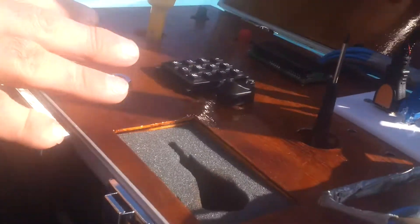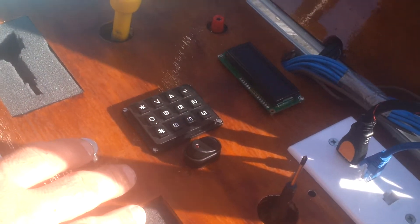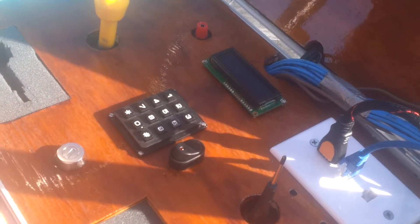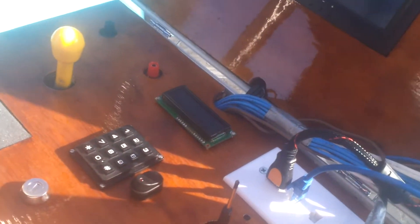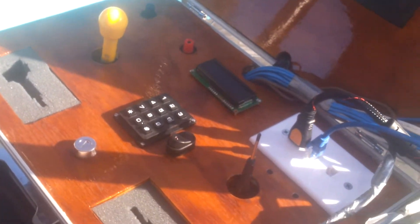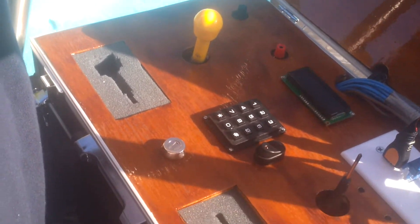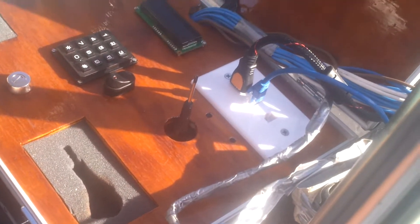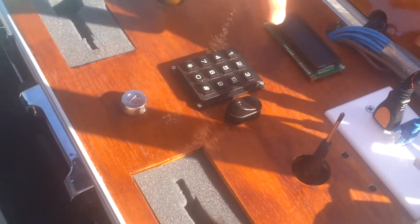For the electronic control, we have it set up here with a keypad. The way it's been programmed is that we punch in a number and it sets the speed via pulse width modulation — we're selecting a certain value out of the full capacity of the motor. It goes through motor controllers, and that's a good way of controlling things: you want to go slow, push one; you want to go fast, push nine, or anywhere in between.